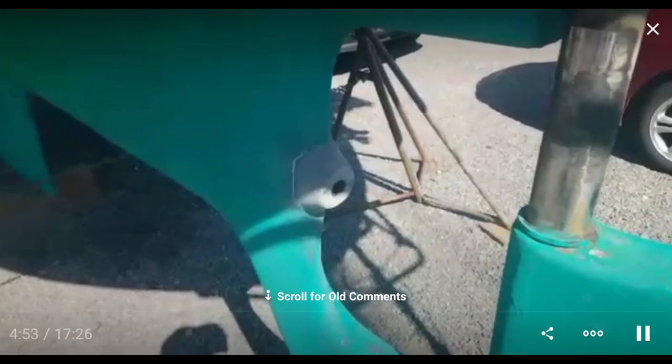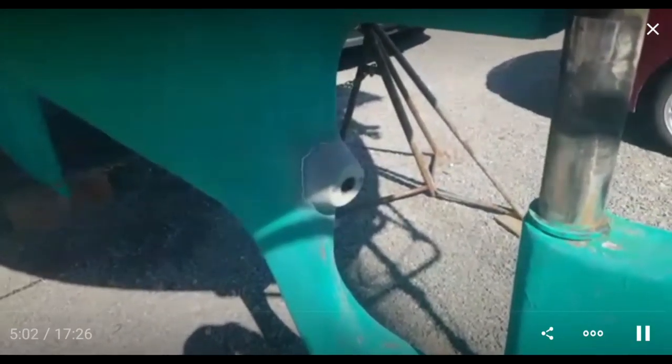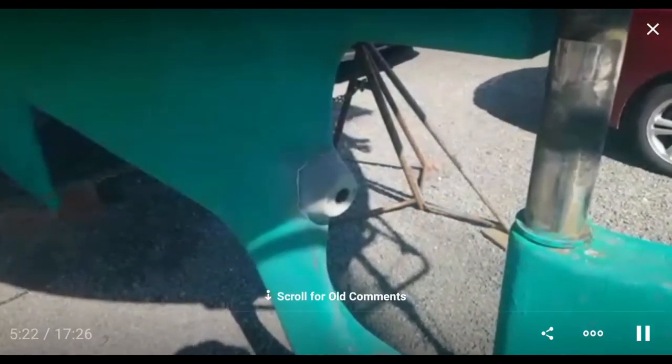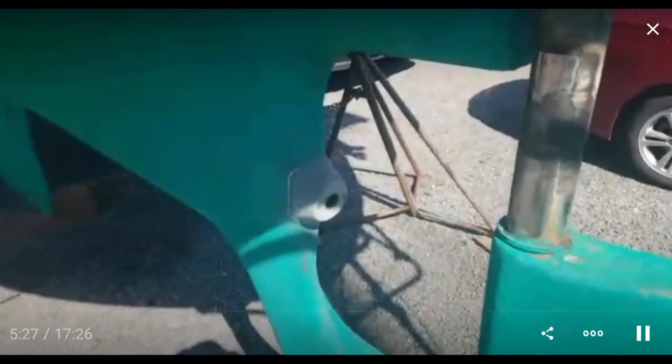Well, that's another story. The specifications for this boat call for a certain size, and the one that's coming or is here. The size, the pitch that's supposed to be on this boat is 10, and the one that they've sent for is 15, which is a massive difference. So we'll have to see. They'll have to put all this back together, put the propeller on, put the boat in the water, start going, and if it's over pitch, then that propeller is totally wrong, which I'm thinking it might be, even though I asked about it once and I didn't want to ask about it twice. So then there's going to have to be a plan B.